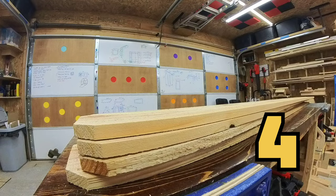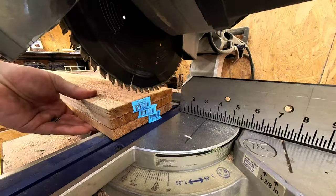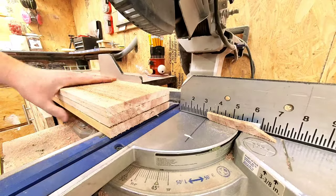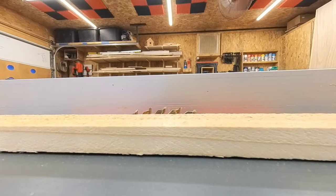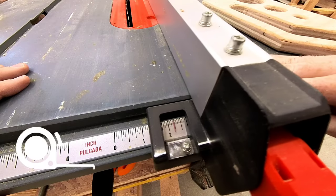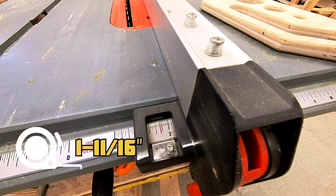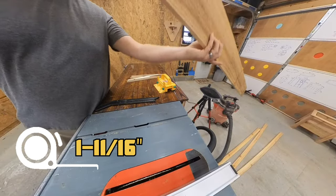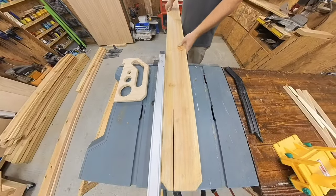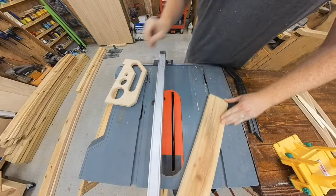This planter box is going to require 7 pickets total. I cut off the staples holding the barcode — the ends are usually rough and not at 90 degrees. Lower your blade so the teeth stick up only an eighth of an inch above the board you are cutting. I set my table saw to a sixteenth of an inch under one and three quarters of an inch, or one and eleven sixteenths. I chose this measurement to get three equal strips for the legs and top lip, with a little sliver taken off the last pass so I know they are all the same size, since picket widths can vary.